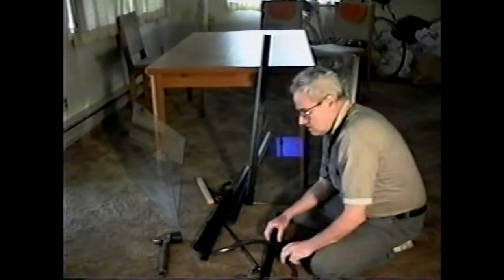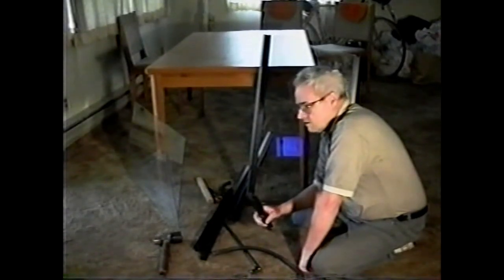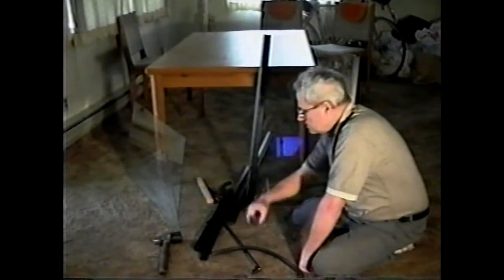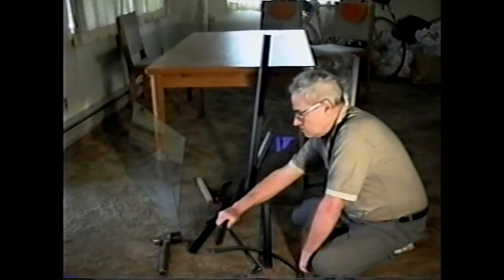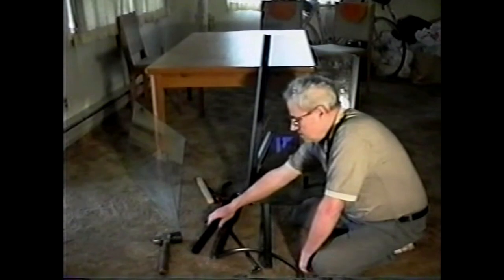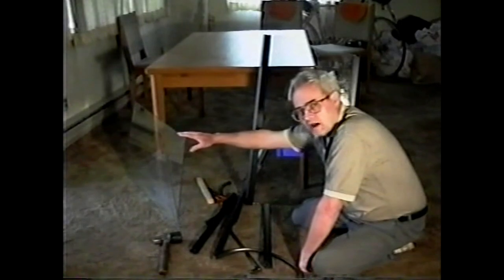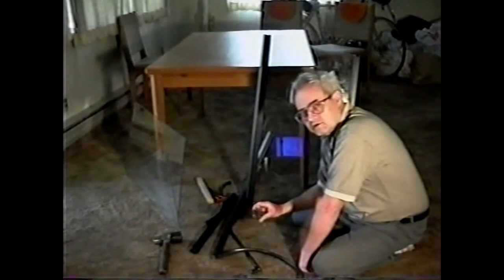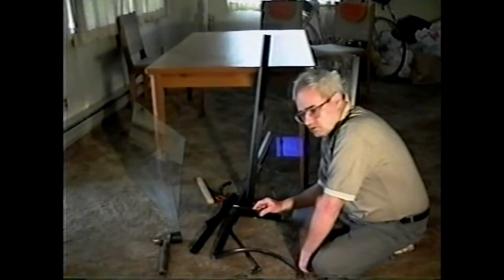Now the moldings you use, or the glazing that you use around the glass, consists of aluminum extrusions. There are extrusions for the posts that have the vertical extent of the windshield that stand up. There are extrusions for the base of the windshield that have an angle on the bottom so the windshield can be tipped relative to a deck. And there are extrusions for the top edge of the windshield that allow a top to be secured to the windshield. These particular extrusions happen to be vinyl, which is rather unusual, but they're normally aluminum extrusions.